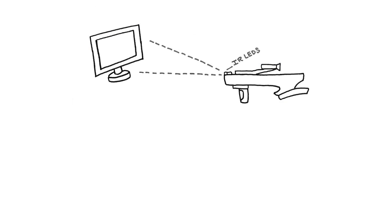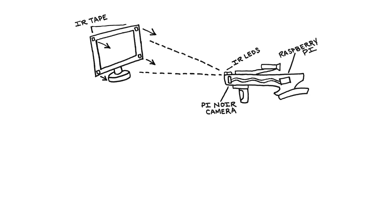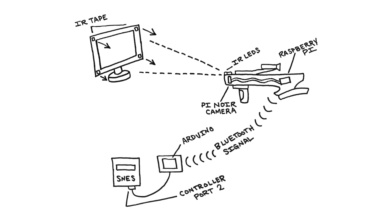Here's the plan: first, we'll turn on the infrared LEDs in the front of the gun continuously. Then we'll put small squares of infrared reflective tape on the corners of the TV to bounce the light back to the gun, avoiding a powered sensor bar. Inside the gun, we'll place an infrared video camera to see the reflective markers. A Raspberry Pi will process the video in real time and calculate the XY coordinates we're aiming at. We'll send the coordinates to an Arduino with a Bluetooth module, and also feed composite video from the SNES into the Arduino to precisely time the signal sent to the console via the controller port.